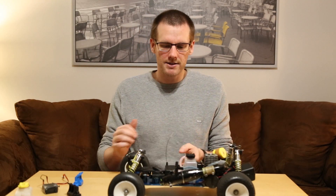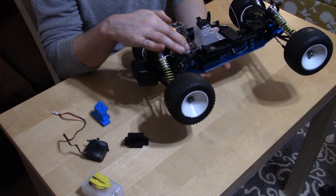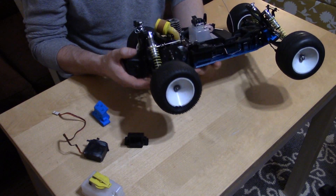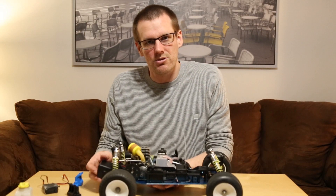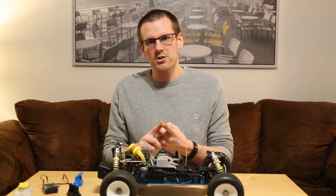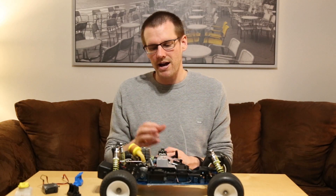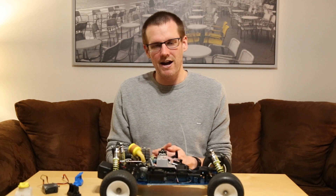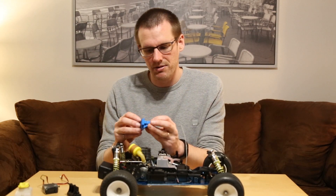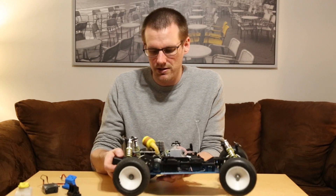Next I want to look at gearing options. I want to experiment and try out a 3D printed gear that matches the existing one identically, and also print other gear types so I can hopefully adapt a gear that's more readily available. First I'll try to 3D print the spur gear as-is to see if it can even be done. I have printed a gear before, but I don't have a good idea of how long they'll last — maybe five to ten tanks maximum before they strip out. PLA doesn't have a good wear factor, so running gears at high speed will eventually rip them up. It's just fun to experiment, especially when time is available.